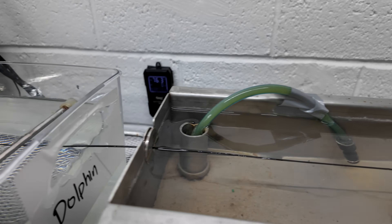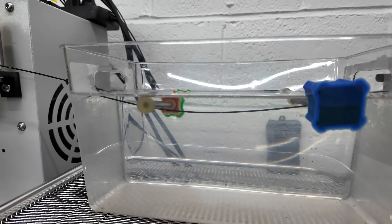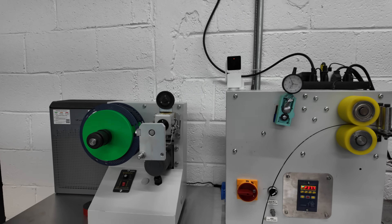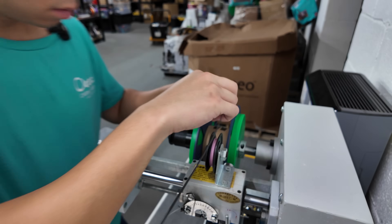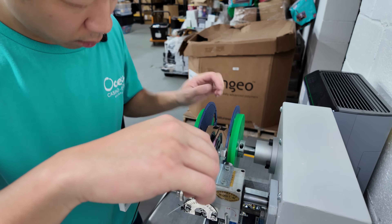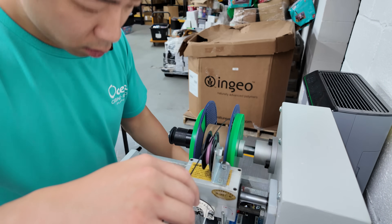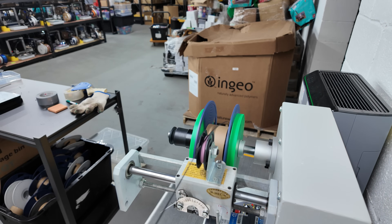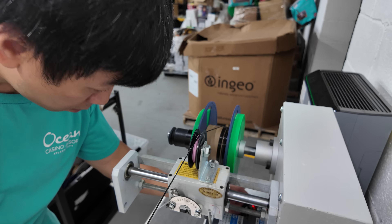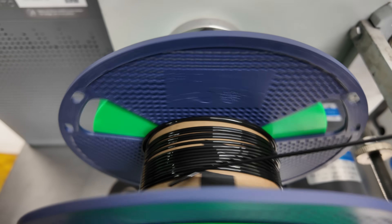The diameter bounces between 1.6 and 1.8mm for the most part. Once the filament is through the rollers and the diameter is consistent after a couple of minutes, I start the spooling process. I have a Sunlu spool and loop the end of the filament through and secure it with tape. I do a couple of manual rotations on the spooler, then turn it on. I have to play around with speed, tension, and roll rate to get it right.